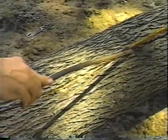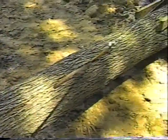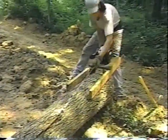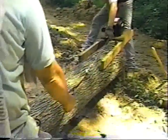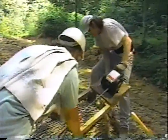It's coming off all on one side. A tree that's grown out in the forest where there's competition on all sides will grow straight. A tree that has forest on one side and open on the other side will grow in a helical pattern, and sometimes it's hard to read that from the bark. A guy like me that splits the tree up wants it to split straight rather than helical. So we'll turn the whole machine onto the side of the log.